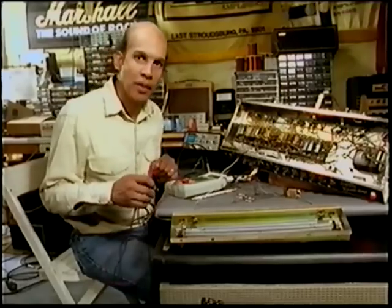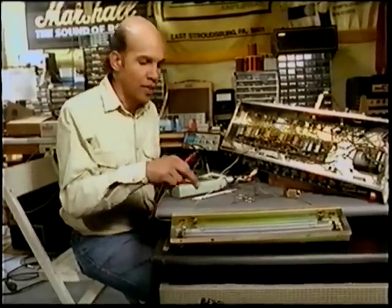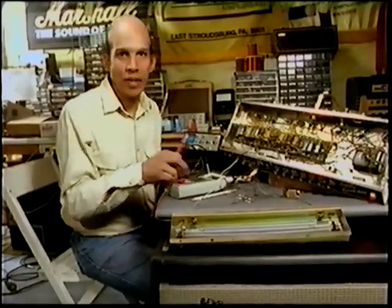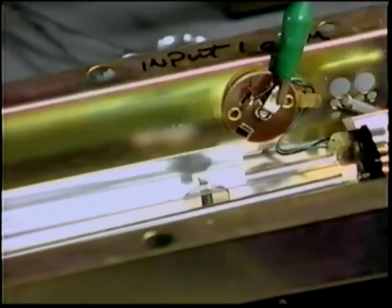Simply take your ohm meter, test for continuity on the cables first, put the cables back into the tank, and test each side. Place your meter on the DC resistance mode on the 2000 scale. One side should be close to 1 ohm, the other side should be close to 200 ohms.